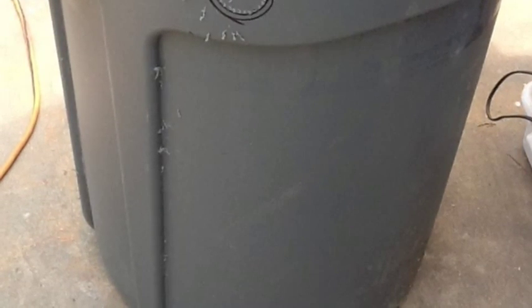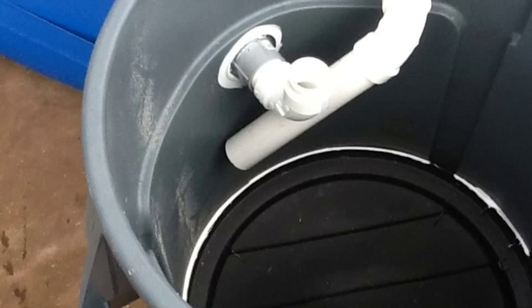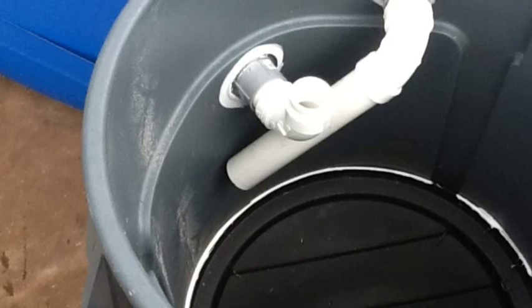If you notice, I've drawn this out and I've pre-drilled some holes. I've tried to use a hole saw and a Forstner bit to go through these type tanks and it never works out well for me. I find that if I just draw the circle, I'm better off to drill a bunch of sixteenth-inch holes and then just cut it out with a razor knife. Next, I completed the PVC fittings on that through-hole and added the 90 with the downturn short-leg that's taking the discharge from my fish tank down into the bottom of my swirl tank.